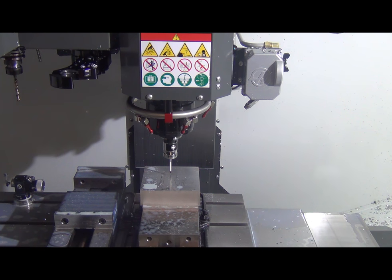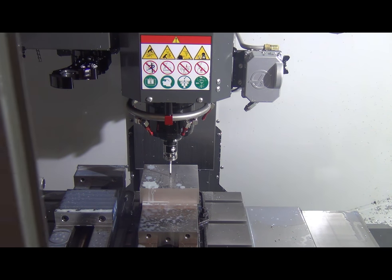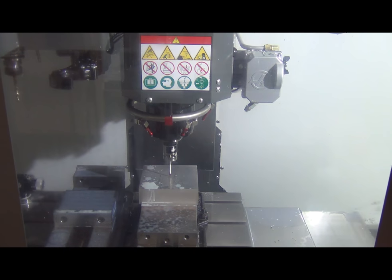So what we're doing is getting this as centered as possible on the workpiece, and then we're going to let the probe dial this thing in for us. So we enter in our X dimension, which is 6.5 inches. Our Y dimension is 6 inches on the nose. We're going to go down from where we're at currently 3/4 inch, and we'll go from there.